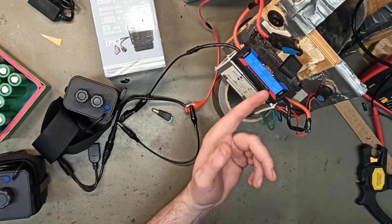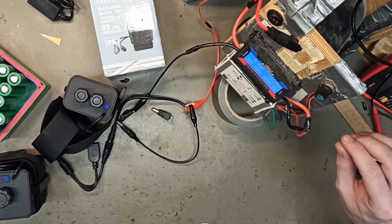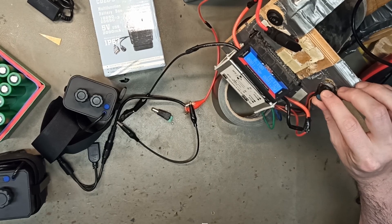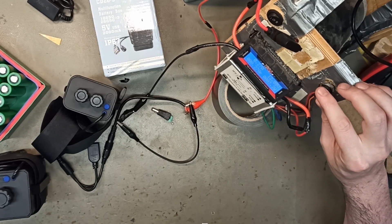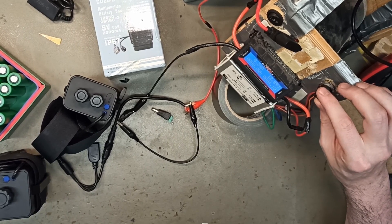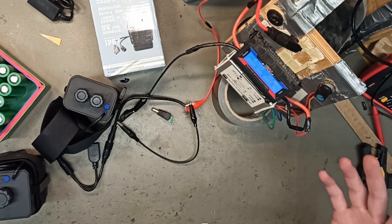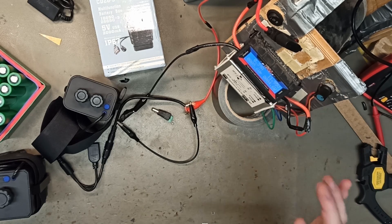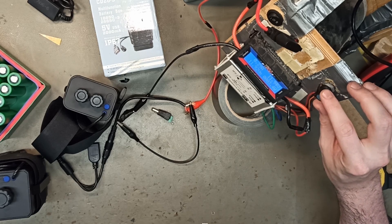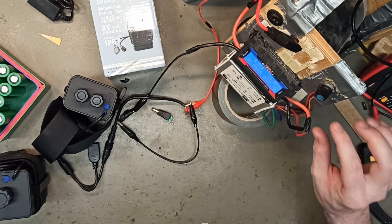There is the on switch and it's measuring 12.27 volts on the wattmeter, going up to 1.6 amps. At 0.1 amp it's still 12 volts. Now at 0.3 to 0.4 amps it's beginning to drop below 12 volts, so it's definitely not for high loads. If you need 12 volts continuous it should really have less than 0.3 amps draw.